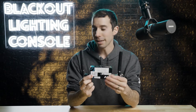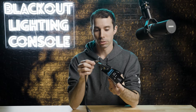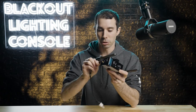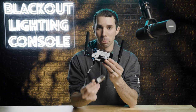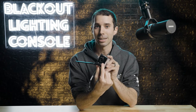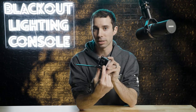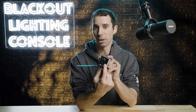You can also send this DMX through its dongle — this dongle connects directly in here and you can now plug this into a gateway. You can also send it data via Ethernet, so you could send ArtNet or sACN directly into this Ethernet port.